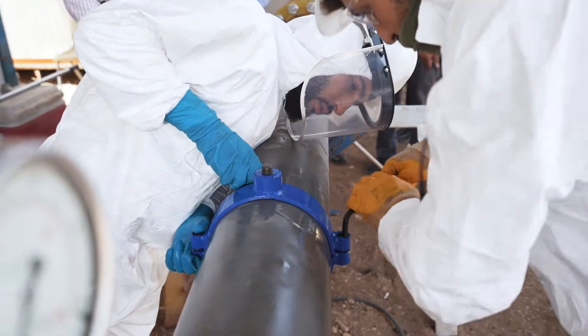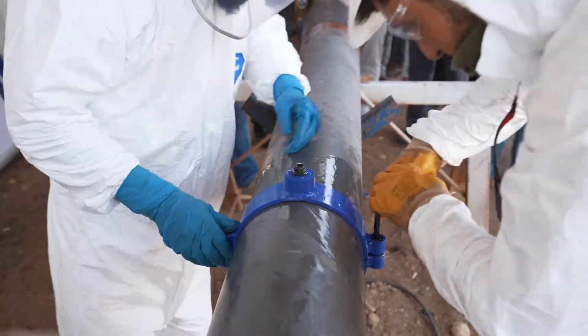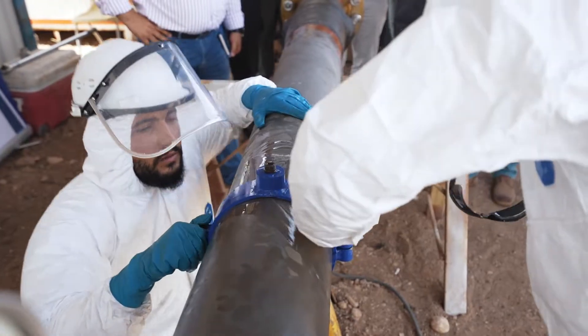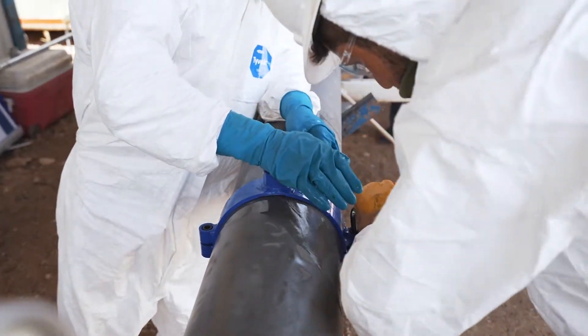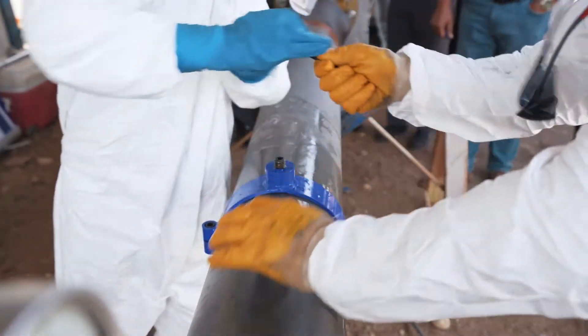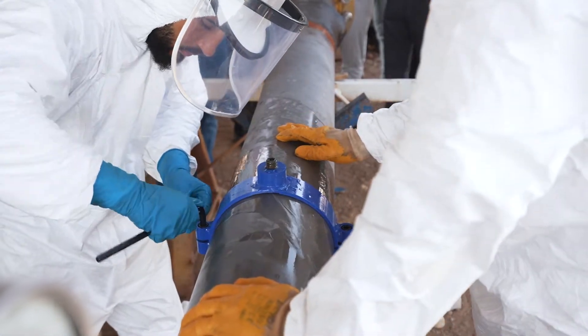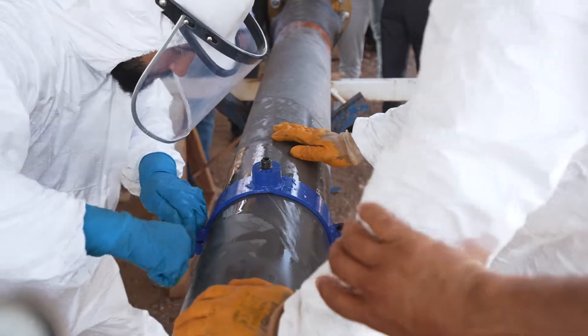The spitzer clamp is resistant to the harsh chemical environments prevalent in oil, gas, and petrochemical industries, and different bungs are applied according to the temperature and media chemical compatibility. The spitzer clamp is engineered to operate in working temperatures from minus 60 up to 380 degrees.